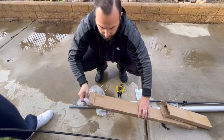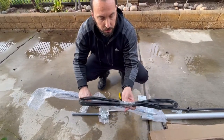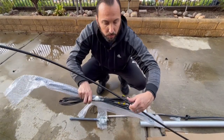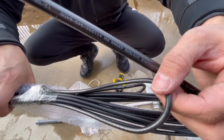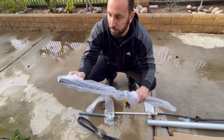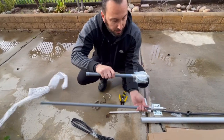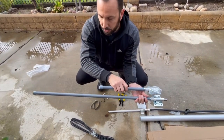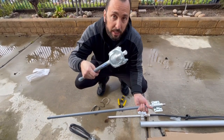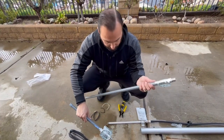So let me show you guys the 10 — this is the big boy right here. You guys can see it also comes with a backup, but like this backup cable is super thin. Let me compare it to the LMR-400. See how thin that is? You guys are going to have more loss, so I recommend the LMR-400. And look at this — this is the 5.8, and then this is the 10. So with the 10, I'm going to be shooting further distance. Hopefully I'm going to be able to hit more people, more beacons, equals more HNT, equals more money.